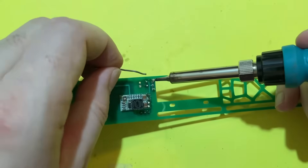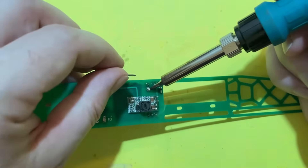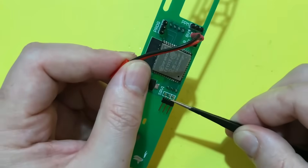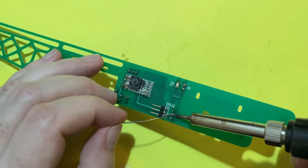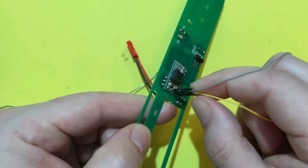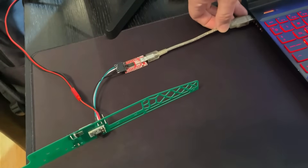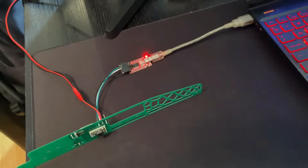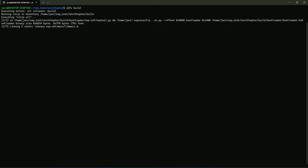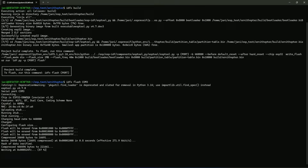After that I added the pins for the radio receiver, then the boot pins, and finally both servo pins were placed and soldered into position. With the PCB completed, I needed to set the output voltage of the step-down converter to 6.4 volts. Then I connected the ESP32 to my computer using a USB serial programmer. To give functionality to the ESP32, I flashed it with my flapping software — the code is on my GitHub, feel free to check it out.